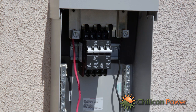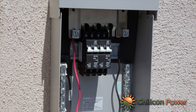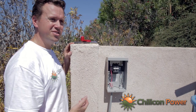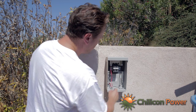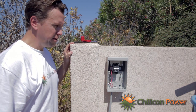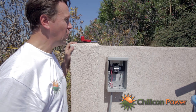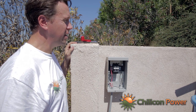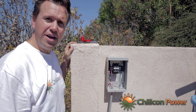In this instance, because more than one 20 amp breaker is needed anyway, we've gone ahead and installed two breakers. There's also a bonding wire here, and the grounding connection that will be applied to all of these will ultimately come to this point. We'll show that next.